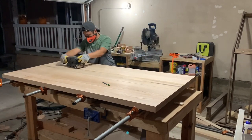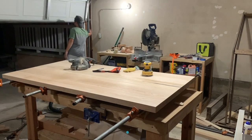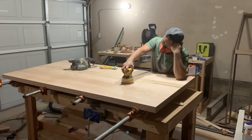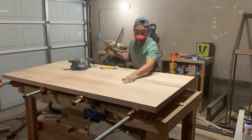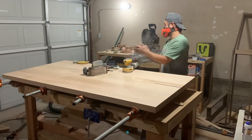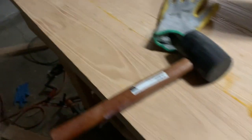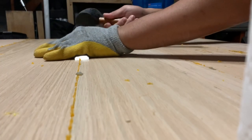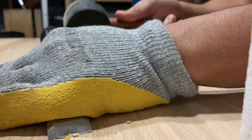It was a lot of sanding. Once I felt like I had everything pretty level, I put the belt sander away and busted out the random orbit sander — more sanding and more sanding. Even though sanding isn't my favorite, it feels really good when you find your project totally flat. Then it was time to flip the table over, and I didn't realize I had so much dry glue squeeze-out to clean up. I took a dull chisel and cleaned up all the dry glue squeeze-out between the joints, then sanded the whole bottom down just like the top.